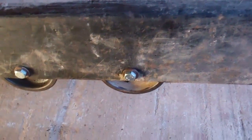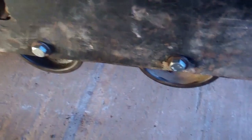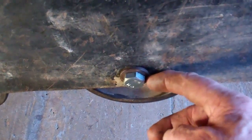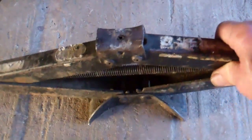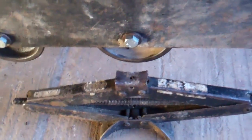I'm putting these back together and I'll get the track back on. I've got the three rollers back on — I've used new bolts and the original washers. The special washers are slightly cup-shaped like a saucer, so the rim of the washer sits tight against the frame and the dome part is against the bolt head. I jacked the rollers up with a small jack to hold them in place while I tighten the bolts.